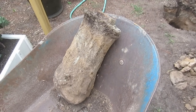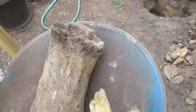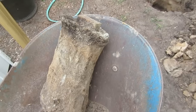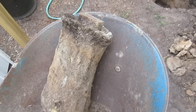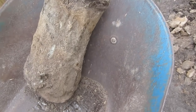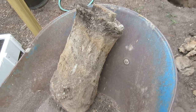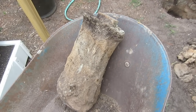As you can see, I've already removed this post. Because I don't do things halfway, you can see when I concreted this in, I actually made a bowl down here which puts more concrete at the base and really anchors that post into the ground. So it wasn't a matter of me just being able to dig straight down and pull it up, because you can see it bowls out here. That's the right way to put in a post that you never want to have to remove — which I never planned on removing, but of course I'm removing it today to put it in the garden.